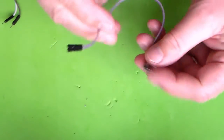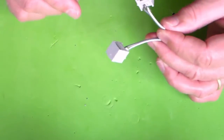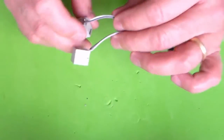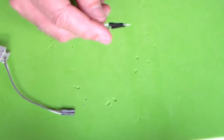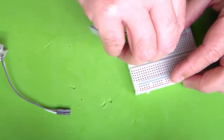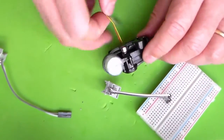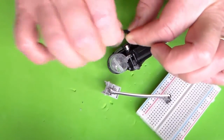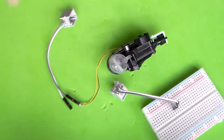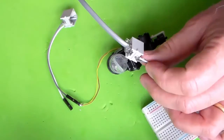Next, I took a pair of jumper cables just like this, cut them in half to create two of them, and soldered them onto those two RJ11 jacks that I took out of the telephone. One has male plugs on it, one has female. The male plugs plug right into a breadboard so I could hook up that end of the joke. And I've got male plugs that plug into the female set for the bubble machine here. Then all I have to do is hook them together with that phone cord.